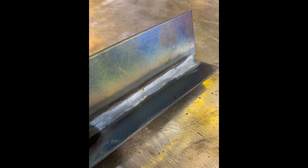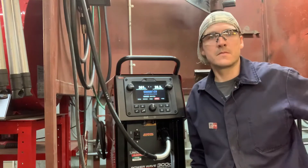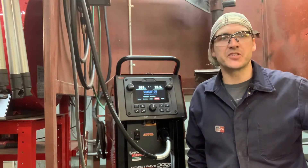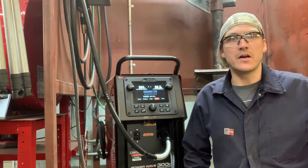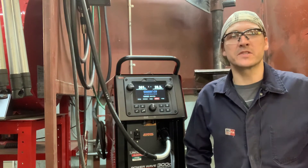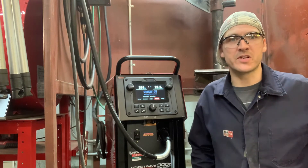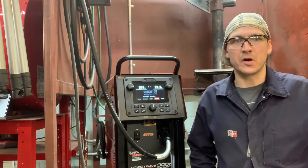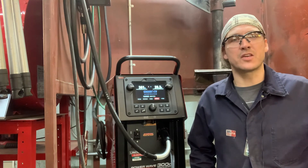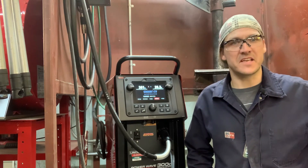I ended up having my wire feed speed at 575. The voltage is an advanced setting with a value of around 0.8 — I'm still looking into how they come up with this value for the voltage. So we're learning about this machine as we go. We know that it has some advanced options and can do some really cool stuff. Stay tuned for more videos on this — I'll let you know what's going on with it, what's great about it, if there's been any hiccups and how we solved the problem. Thank you for watching — keep your lenses clean and be safe.